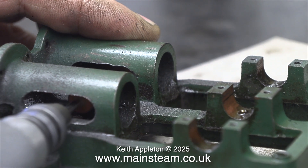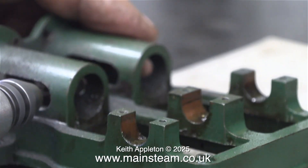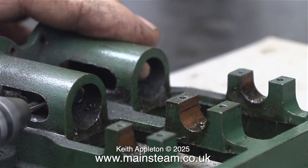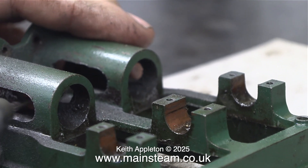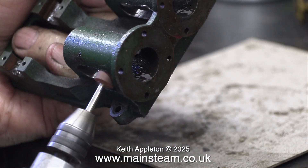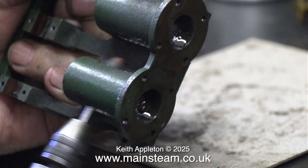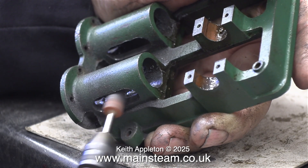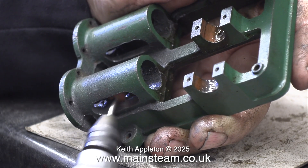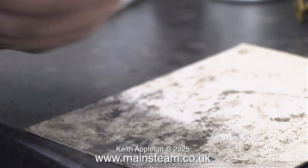You can see how rough the other side is — I haven't done that yet. It's not a good quality grinder; I think it's out of a set that I bought in the centre aisle of a local supermarket, but for this application it is perfect. You have to control it at all times though. I've got a firm grip on both the casting and the drilling machine. It's important that the grinder does not slip and grind where you don't want it to.